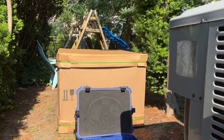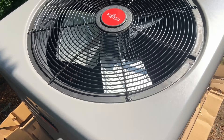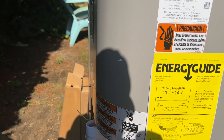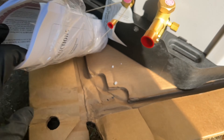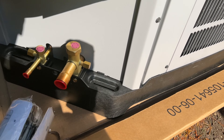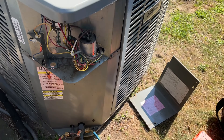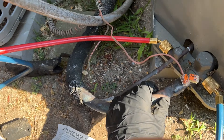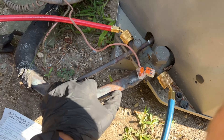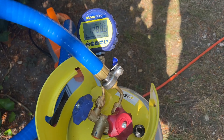I'm going to open up the new condenser and get as much ready as possible. Here we have the new condenser — it's a Fujitsu. From my understanding it's just a Rheem with a different name on it. I've got our instructions, our filter dryer, seven-eighths and three-eighths, 410A, four-ton — so it should go right into place. I'll cut the line set right about here, straighten it out to get further in, and silver-braze the connections while I wait for the recovery tank to vacuum down.